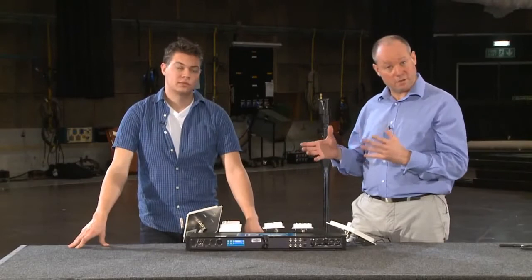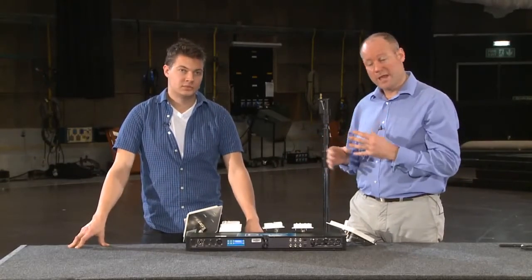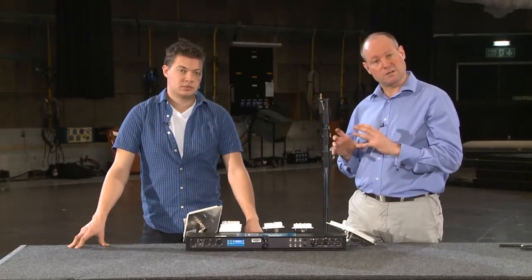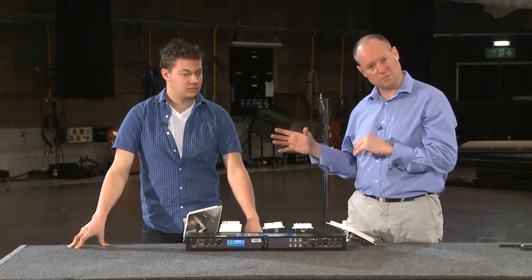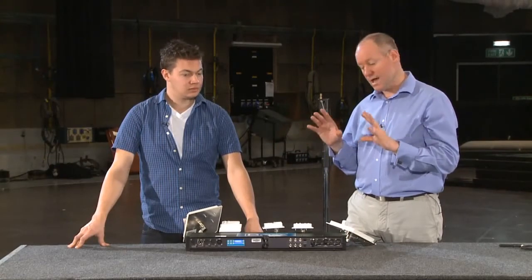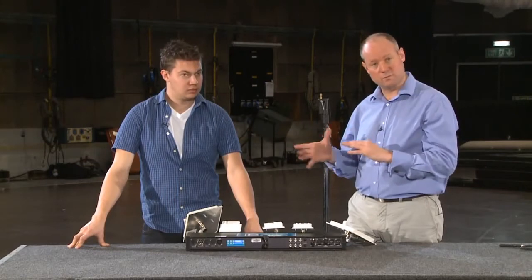The transmitter and receiver need to be on the same frequency. They also need to both be in broadcast mode, and they need to be in the same region as well — EU, US, Custom, or Custom 2. Make sure they match or they won't talk to each other. That's a very important thing, and you can adjust it within the menus.